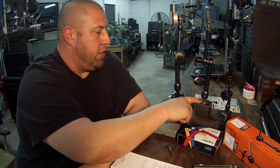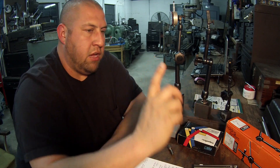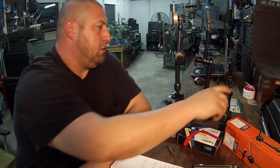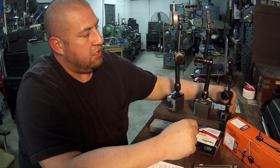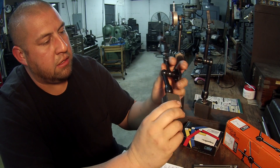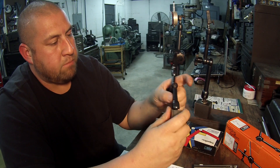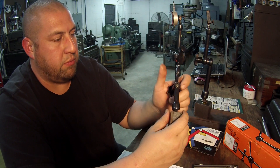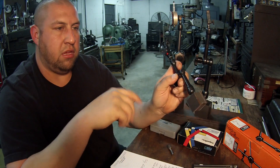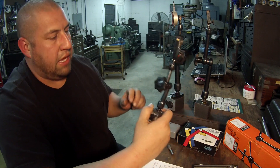You can also buy these without the magnet — they screw in via a hex, either 8 or 10mm tapped holes in the magnets. Tom Lipton over at Ox Tool did a video where he bought one of these smaller units and modified an indicator attachment for his Bridgeport mill, tapping a hole so he could screw the Noga arm directly into the attachment instead of the factory arms.